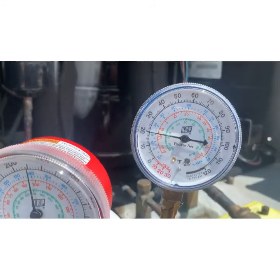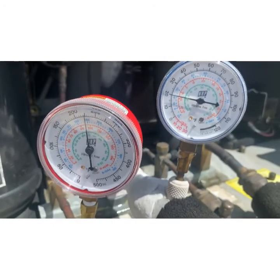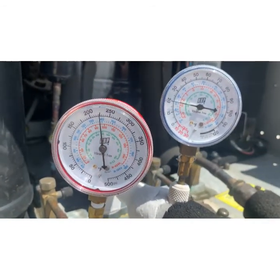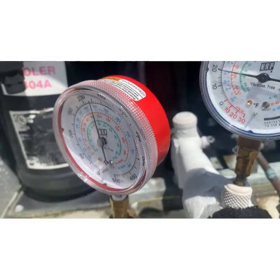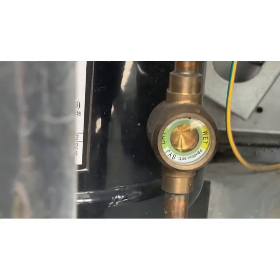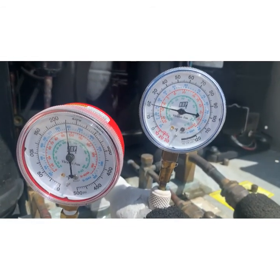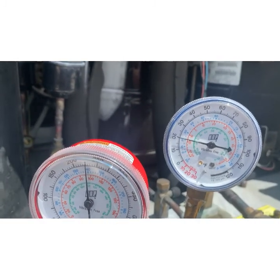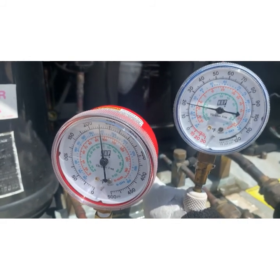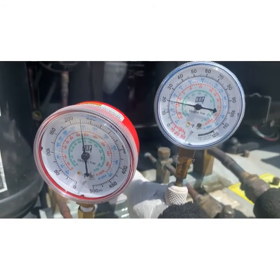Now, negative 10 and negative 17 are both stupid freezing, and they're both going to freeze up a little bit. But I'm tempted to put a little bit of gas in this unit because it can take it. When I look at the sight glass, which I'll show you, see these two. These are your sight glasses. The front one's for the cooler, the back one's for the freezer. And it's not bubbling, so it's not egregiously low on Freon. There's no issue with that. But that's what the gauges tell me. It doesn't need Freon, like, oh no, we're low. We're not flashing, but the pressure's a little low. But while I'm here doing a PM, I'm going to go ahead and put a splash in it, bring that up to about 25, 26 psi.